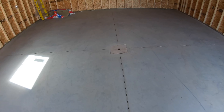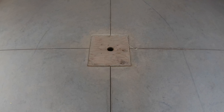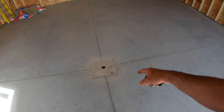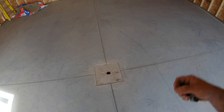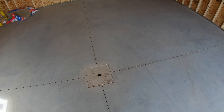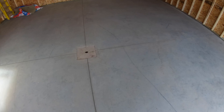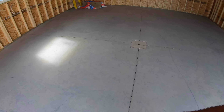When they poured the concrete, they got a good slope from all sides over to this pit. There's a plywood cover on it right now, but there's about a five-gallon pit down in there — they'll put a metal grate on it. In my opinion, it doesn't drain anywhere; it's just a containment pit that has to be pumped out or relies on evaporation. I'm not sure that's really big enough. When you're bringing a snow and ice covered vehicle into a heated garage here in Canada, that five gallons is going to fill up pretty quick — especially with two vehicles.